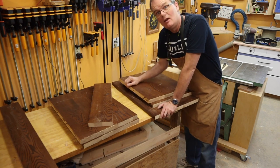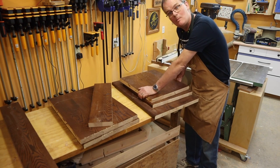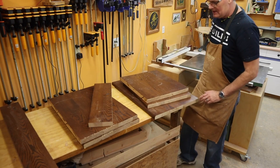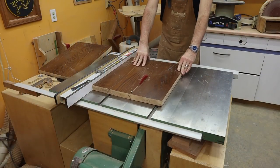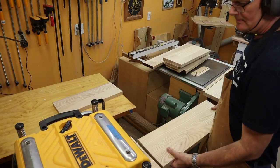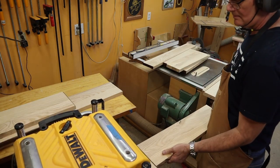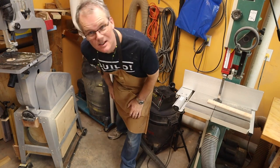So I'm going to plane it all, which is going to complicate things because these are all fairly wide. My planer is 13.5 inches, and this is the top, the two shelves, the two sides. I'm going to rip them down the middle, get it all planed, and glue them all back together. These all have seams on them, so I'm going to try to just split the seams so I'm not adding more seams. Then there was a whole bunch of planing, and I skipped most of that because it's boring.